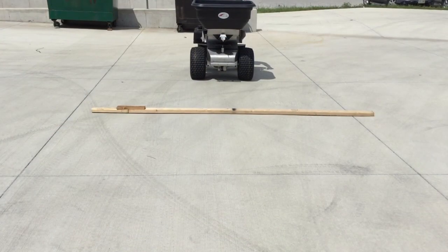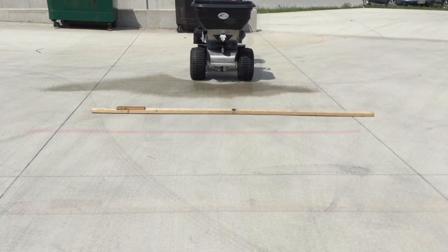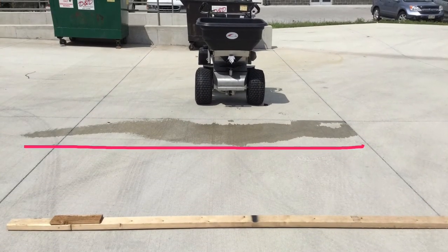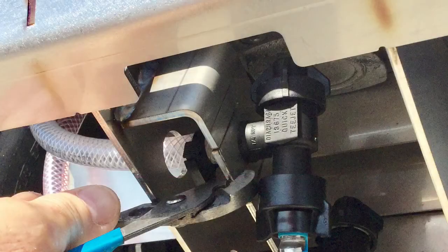This last example for the wide tip is if your pattern is straight but too far to one side. Using pump pliers or a small crescent wrench, bend the tab that the nozzle is in slightly. Bend the tab in the opposite direction that the overspray is occurring, being careful not to overcorrect. The metal tab should match closely to the metal frame around it.